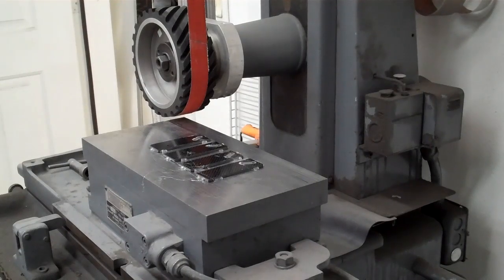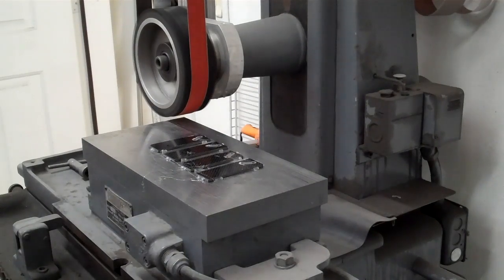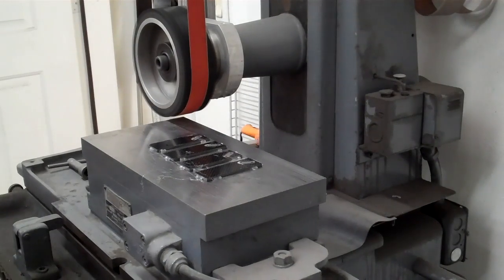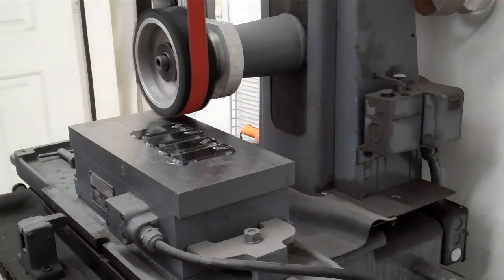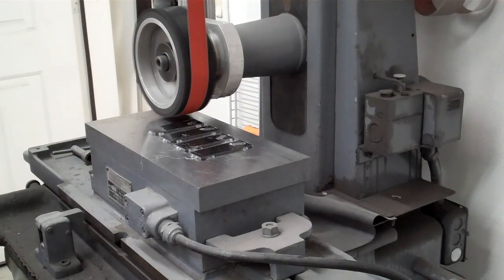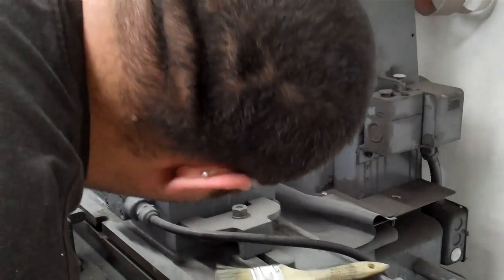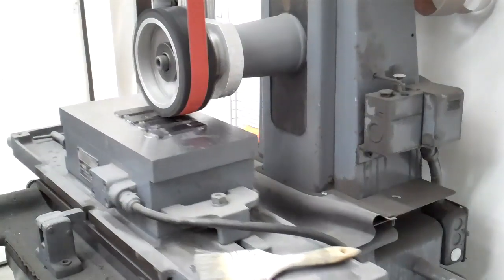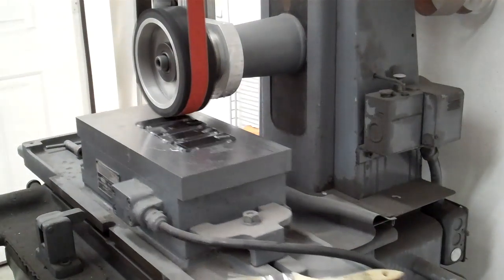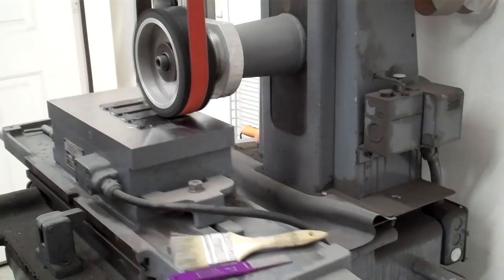Hopefully you can hear my narration as I go. I fire up the surface grinder and come over to center the belt over the top of the titanium, because the titanium and the epoxy is the high spot. I center it up good, then start downfeeding until I get a little spark, and I know I'm down at my surface.